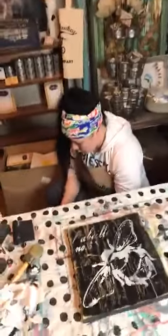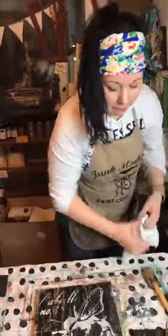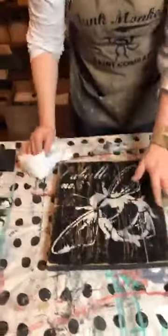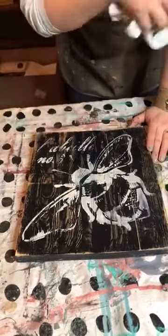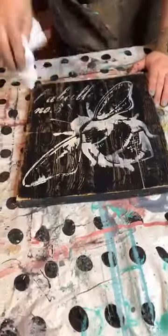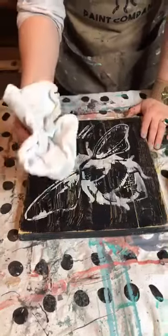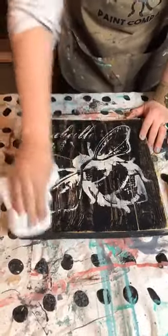The next thing that we do is take out one of our buffing cloths. And then how do you clean your wax brush? Sure, we can talk about that. All right, let me go ahead and take care of this real fast. So we've got our wax on right now, right? Our polish on. Now, I always say, because everybody knows Karate Kid, you wax on, you wax off. We've waxed on in the circular motion. We've pushed it down into the wood pores. It closes off the wood pores. Then we take one of our awesome cloths to buff off the top residue, right?